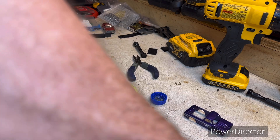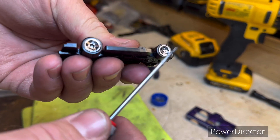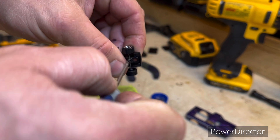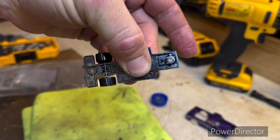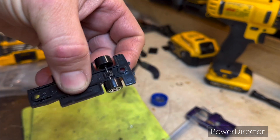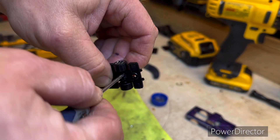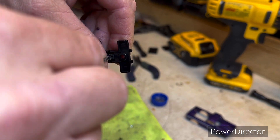A lot of people snip them so I'm going to pry that up from there — there's no use in that. I may want to use those on something else so I want to save them. Just going to take a screwdriver, place it right there, give it a twist. See all I'm doing is standing those up — pull that axle right out. The axle's not bent. Run your screwdriver in there, the new one will lay right in place. Switch it right around, do the same thing, twist it. We're going to save those.